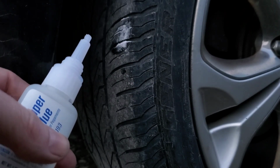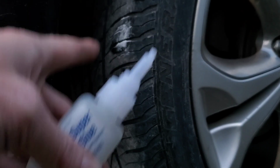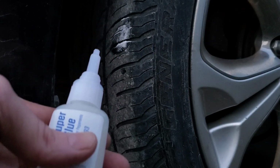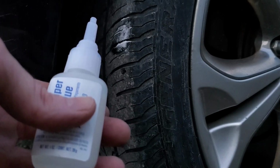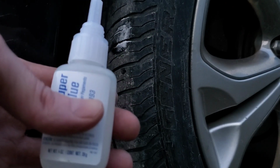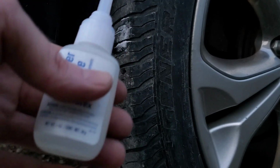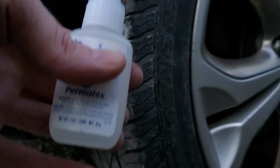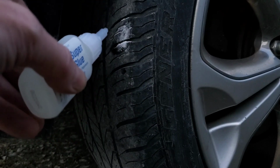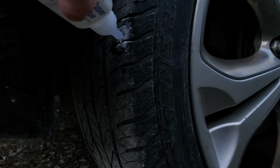Okay, before you decide to fix an O-ring, the first thing that you want to ask yourself is if it's a dynamic application, which is moving parts coming into contact with the O-ring, or a static application, which is basically no moving parts coming into contact with the O-ring. If there are many moving parts around the O-ring, then I wouldn't suggest using that method. However, if not, then proceed with caution. Not only can you splice an O-ring, but you can splice one that's not even circular. That's right, one that's not even circular.